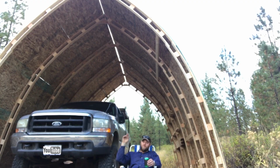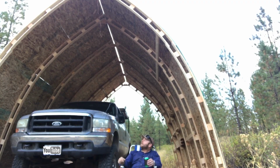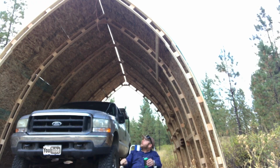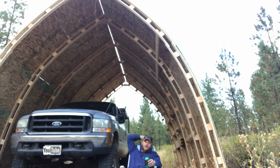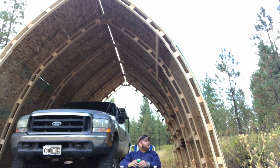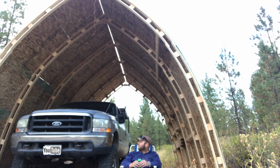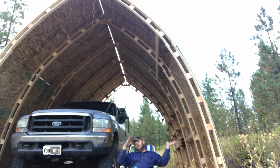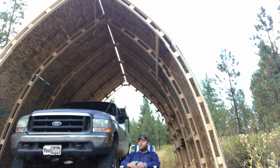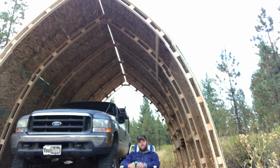I wasn't quite sure how to put up the last course, I guess maybe, of the sheathing. And so I largely just screwed it in from the underside, which I know is not as good as screwing it in from the outside, but I didn't feel quite comfortable climbing up on the outside. It's a pretty sturdy structure, front and back, but when you start to push on it, it'll sway a little bit, and I was a little bit worried about that. So I think what I'll probably eventually end up doing is putting some cross beams in there just to girt it up a little bit.